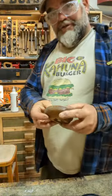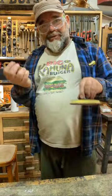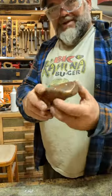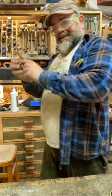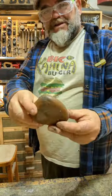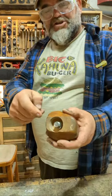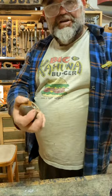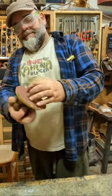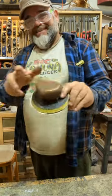So what I did is I thought, oh, I know, I'm going to make myself a sanding pad handle, an ergonomic one. See how ergonomic that is? It's like the holds on an indoor climbing wall. Basically I mount that in there, put a little pin through and nailed it all into place. I create the clearance hole there, and it works so well. So that's basically my sanding pad, and I use it a lot.